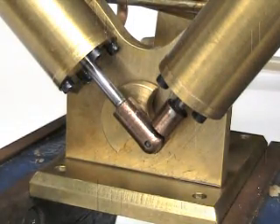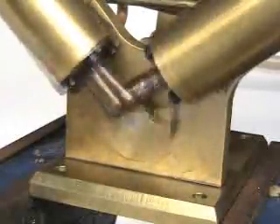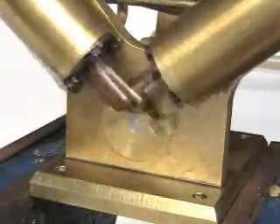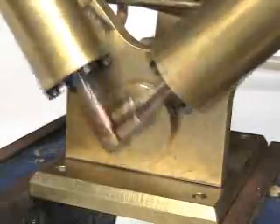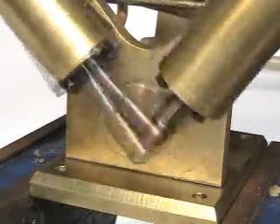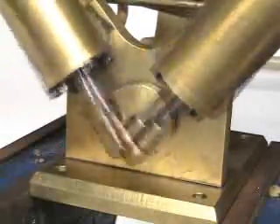This gives another view of the pistons and connecting rods to the crankshaft. You'll see that the lower end of each piston is blocked off with a simple sealing gland so that air pressure or steam can be applied to both sides of the piston, meaning pressure is working in both directions when running.